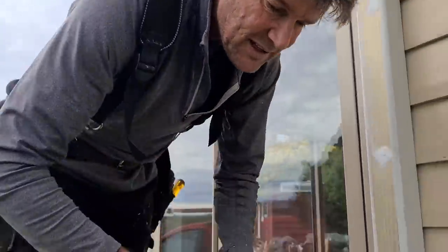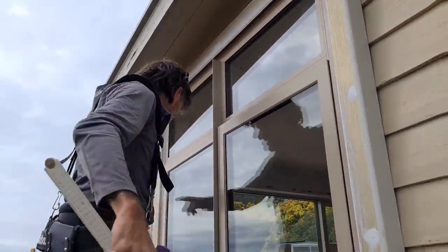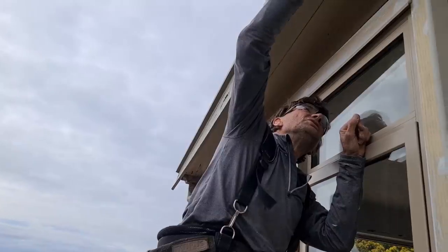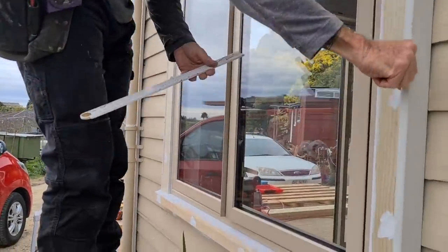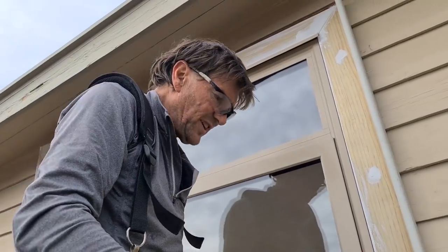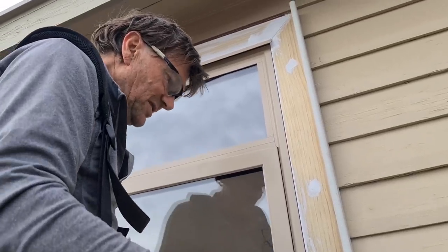Right. But the procedure is first to get it parallel to the finished surface. So what happens is it sticks a bit proud, as you can see. So it's like about 3, 4, 5 mils. So what I do is I make sure that off my facing this is a consistent width all the way up, so that it's going to finish in the right sort of relationship with the facing. And an old wall like this is a little bit bent sometimes, so you got to allow a little bit. It doesn't always get perfect, but this is the theory.